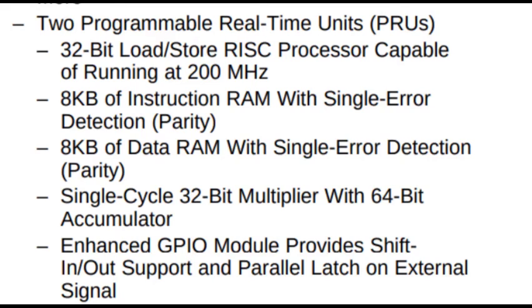These two cores are totally independent of each other. They handle all the IOs, GPIOs, I2C, ADC, SPI, CAN, and everything. So they can take care of all real-time applications independent of the main ARM Cortex core, and handle all data acquisition or controlling of external units, relieving the main core from real-time events.